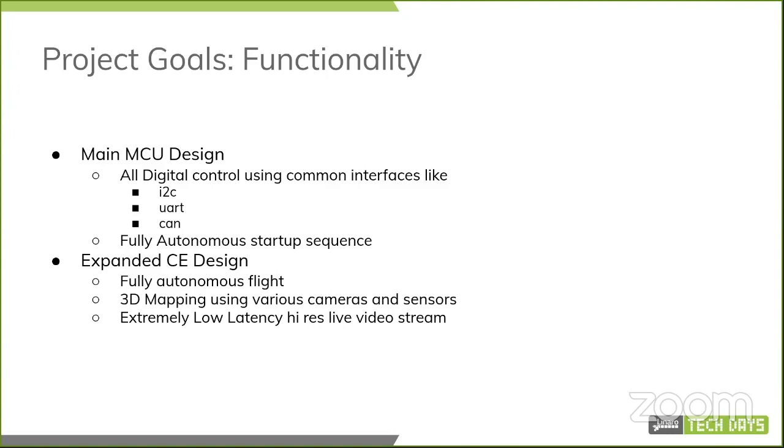Now, this is a place where we really need to innovate, because currently people use analog video sources and transmission, since that provides the least latency, and for FPV purposes that's the best scenario right now. But if we use really smart compression, fast FPGAs and custom designs, we might be able to compress the data and transmit it wirelessly while still maintaining the high resolution that a digital source may provide us.